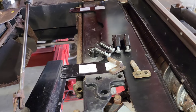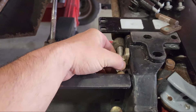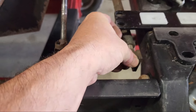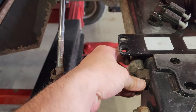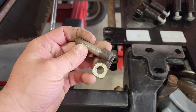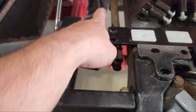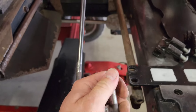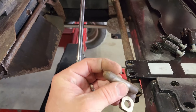Just got to put the right side deck plates in. The way these things pivot — this pin goes in this pipe, and when the pipe moves, it's bolted like that and the pipe pivots on it. Those things are always frozen up so tight that when that pipe hydraulically moves, it'll bend this bracket. Most all of those were frozen in there — we had to heat some of them to get them out, then clean them up good and anti-seize them.